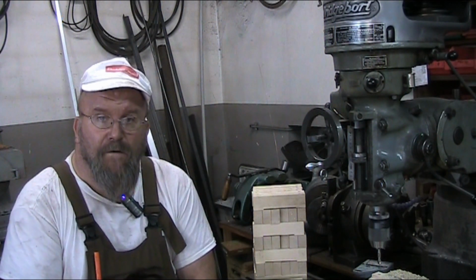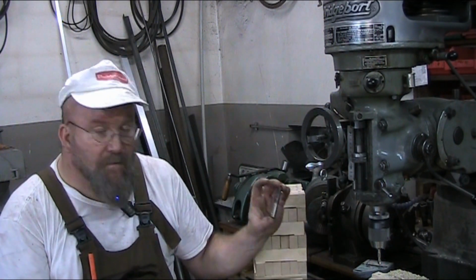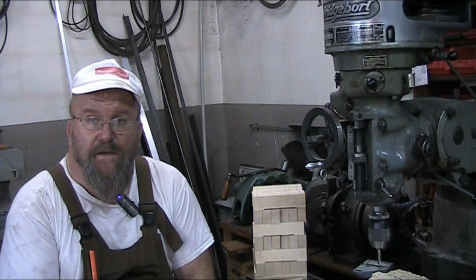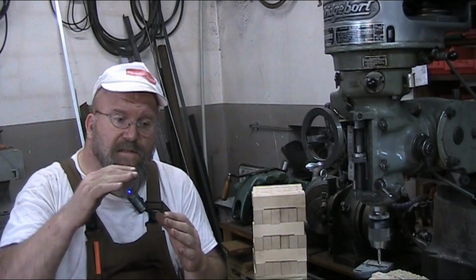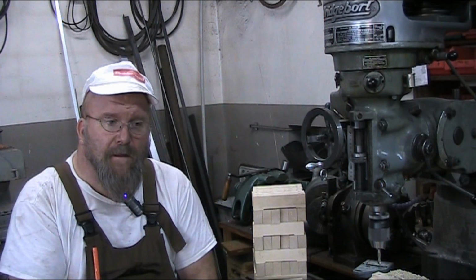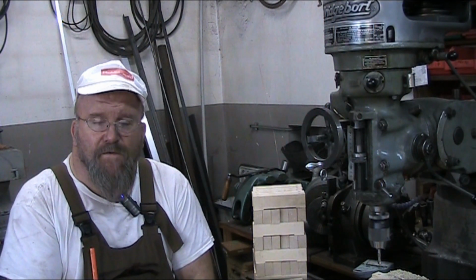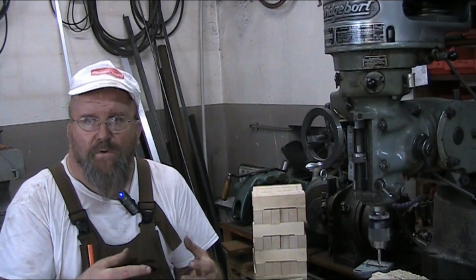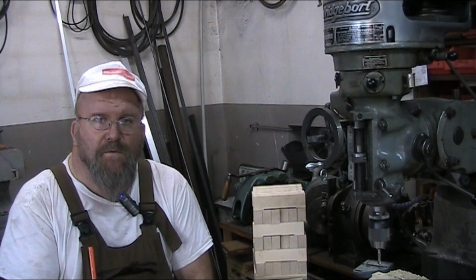Now what I did, I went into eBay and picked up a bunch of old junk drills for the purpose of making a set of stubbies. And like I say, this is something that I'll use to drill into pipes or sheet metal and other projects, or on slightly slanted surfaces where I don't have the luxury of using an end mill or a pilot drill to get a hole started, if time and so forth don't allow for it, or if it's a quick job where accuracy isn't all that critical, then I'll use a stubby drill on that, and that seems to work pretty good.